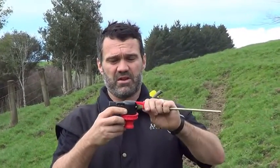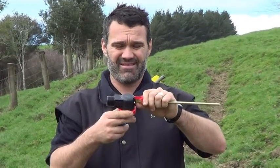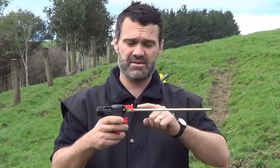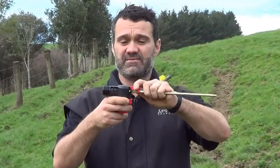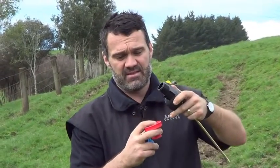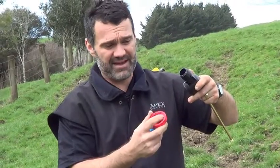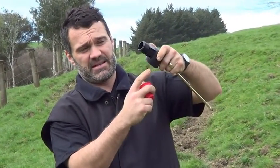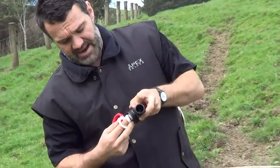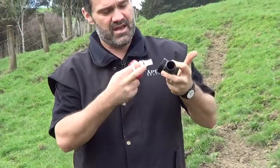The other key aspect was that when you're going past a trough on the farm and you've got an issue with your valve, you need to be able to service it there and then. What the farmers came back and told us was that you need to be able to service this valve without tools. Traditionally you have to straighten the cotter pin to take the arm out, but with this valve you don't. You simply unscrew the bottom of the cap with your hand — there is your washer which the sleeve sits down on top of, sealing off the valve, and that can be replaced. To re-establish the o-ring integrity inside the valve you can simply lift the arm and take that out.